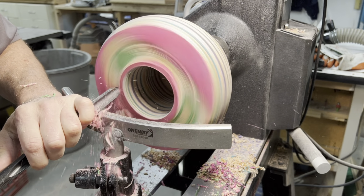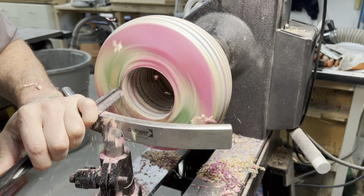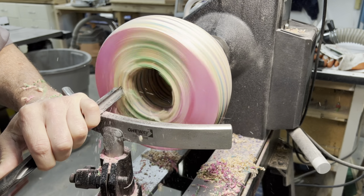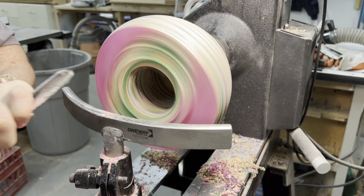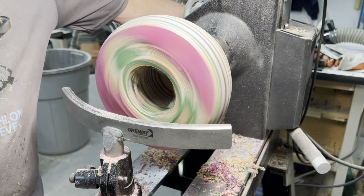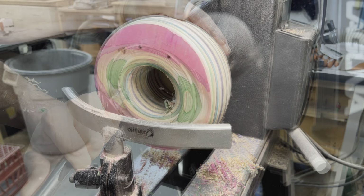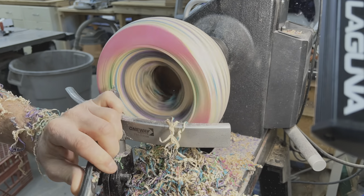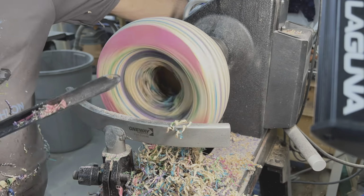And now I believe that's my 1/2 inch bowl gouge that I just returned to. I think it's sharpened right off the grinding tool, and I'm just going to take some time and take one pass at a time and hollow out the center until I get the shape I like, and sand both the inside and outside smooth, and then we'll get on to the finishing process.